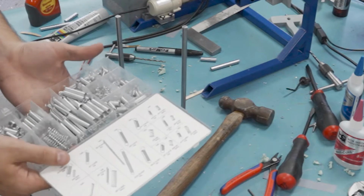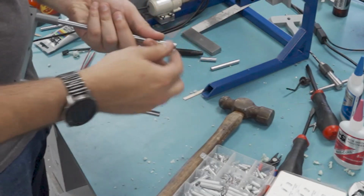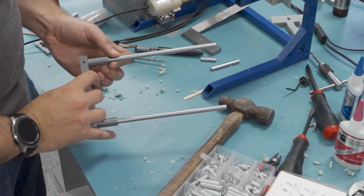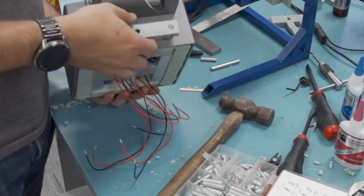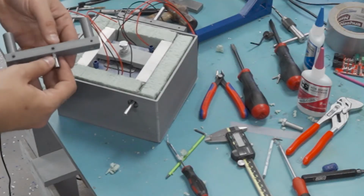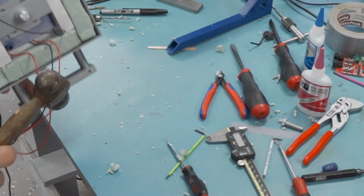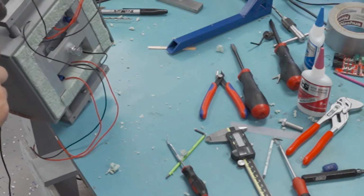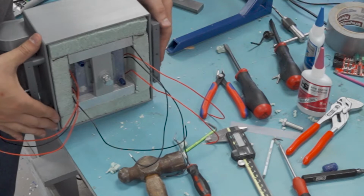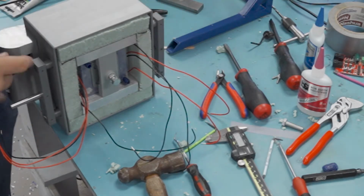Then I'm going to be putting springs on either side of the block so that it can rattle back and forth between the two springs and hopefully not just shake the entire frame. So I'm going to have to put the block on the rails and then a couple more springs, and then I can tap on the other side. And now you can see the spring action here. Now this is only going to work at certain frequencies, so we'll have to play with that.